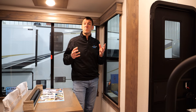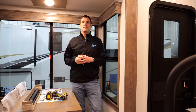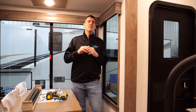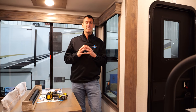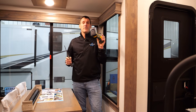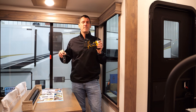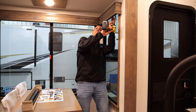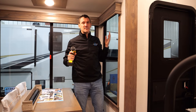The first question is: how do I get my valance down? Taking off a valance on the roller shade is extremely simple. We basically just use an L bracket — there are going to be two to three depending on how long the valance is. It's as simple as getting either your powered screw gun or a screwdriver with a long shaft and a number two square drive bit. You find those angle brackets underneath, undo those, and the valance comes right down.